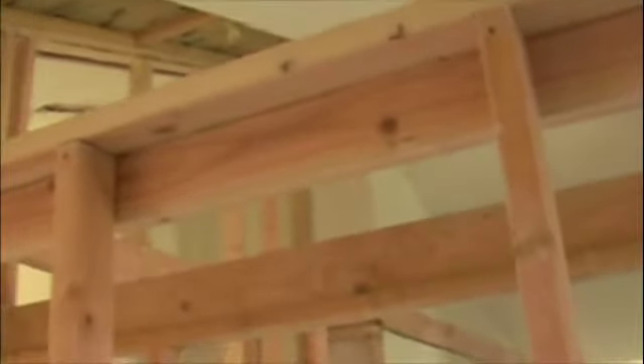And this is kind of cool — over here, we realized if we continued with the eight-foot ledger, it would be impossible to get into the storage space. So we lowered the ceiling in the closet to seven feet. It's not going to bother you any, and that still gives you probably about two feet to crawl into that upstairs area. Right now we've got the whole opening framed out, but I could make it a smaller opening if you wanted to. So that's what's happening.